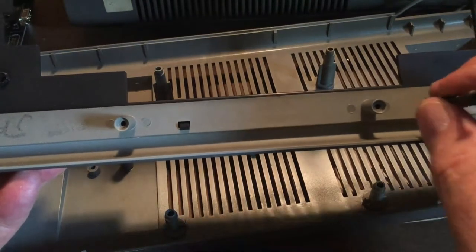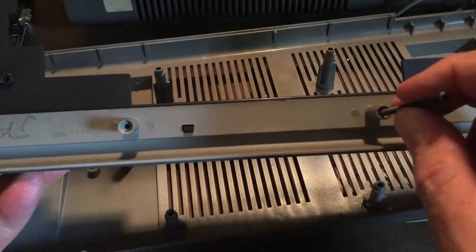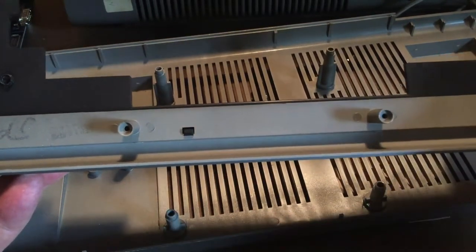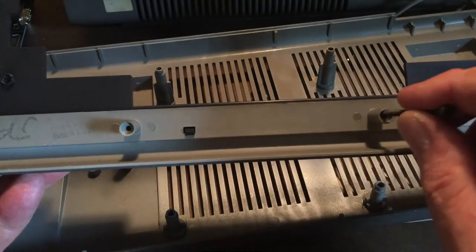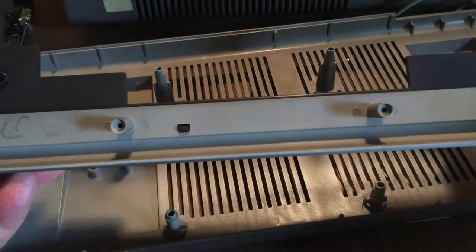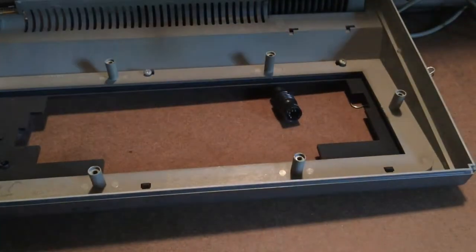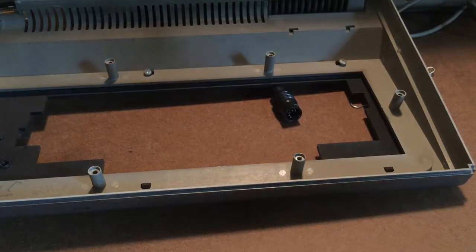It's really common for people to back these screws out, do work, just throw the screw in and crank it in. And if you don't do it correctly, you'll cut in a new set of threads, and the next time you'll cut a new set of threads, and pretty soon you have so weakened the plastic in there by cutting thread after thread that the screw no longer fits, and you get looser and looser screws and they don't pull tight. There's a pretty simple secret to putting these back together, and I will demonstrate it here.